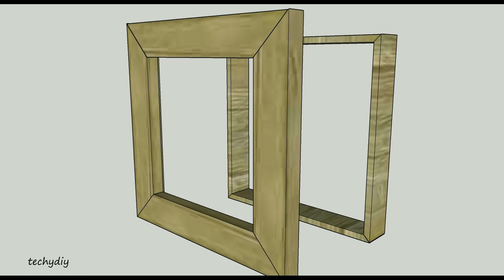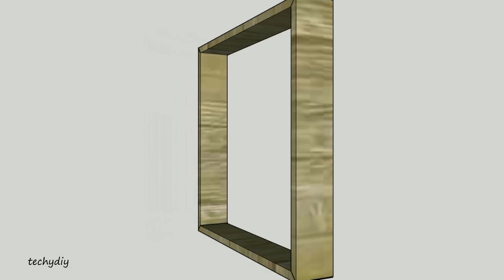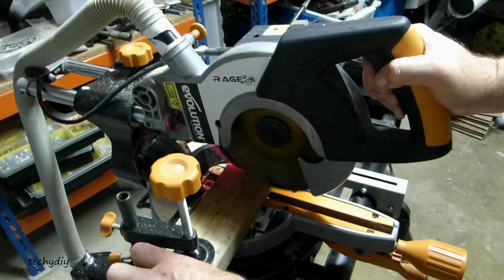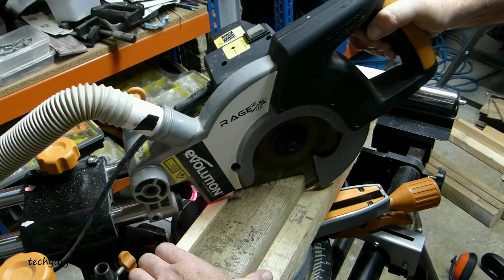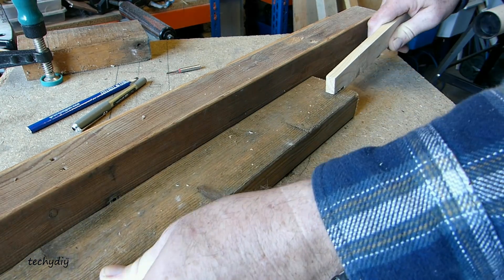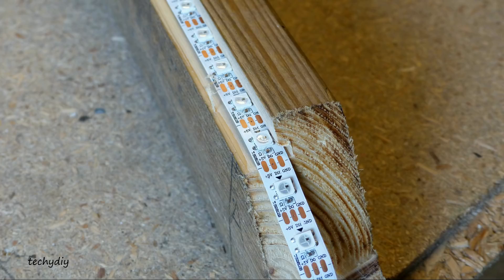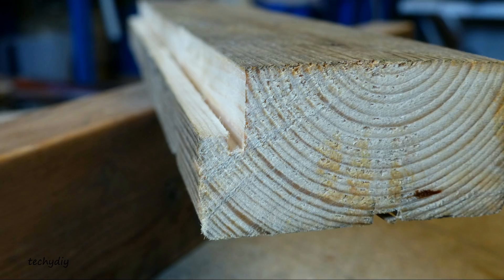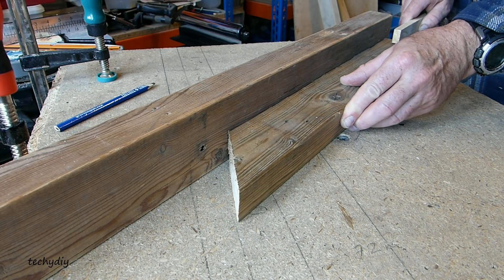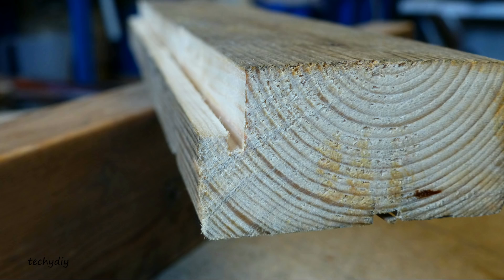The frame for the mirror is made in two sections that are glued together. The front section is made from some old framing timber with a rabbet or rebate cut along one edge in which to locate the mirror tile, and then a second section is made out of pallet wood to increase the depth of the frame. I started making the front section by cutting the framing timber into four lengths and then cut a 45 degree angle on one of the pieces. I set the fence on the router table to cut approximately 6.5 millimetres or a quarter of an inch and routed rabbets into all four pieces of wood down to a depth of 9.5 millimetres or three-eighths of an inch. The piece cut to 45 degrees is where the LED strip will be located, and to accommodate it I'm going to route an additional groove or slot so that the edge of the mirror can sit directly on top of the LEDs. I changed the router bit to a 3 millimetre or one-eighth of an inch straight bit and routed a groove on the end of the existing rabbet down to a depth of 13 millimetres or half an inch.